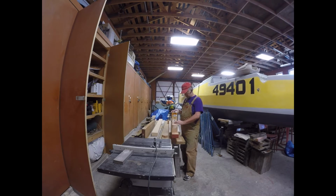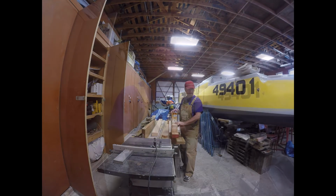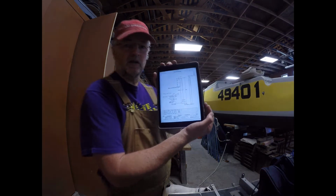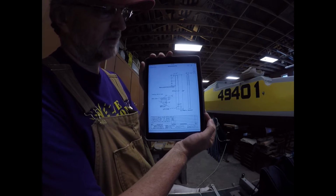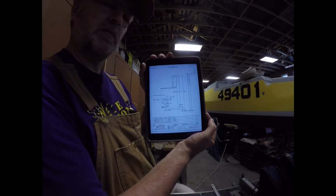When I go to install it, this is going to be inside the boat, so I'm not going to worry about it. But the exterior pieces, like the boomkin pieces, I will drill them oversized, fill them up with epoxy, and then re-drill them. Fortunately for me, I've managed to procure blueprints for just about the entire boat. If you look here, you can see I've got the blueprint for the sampson post, so that's what I'm working towards, getting it into that shape. I also have the old sampson post to use as a...